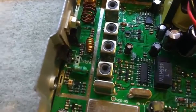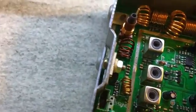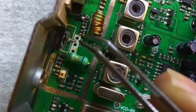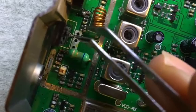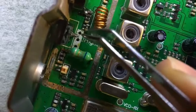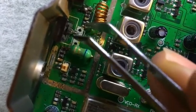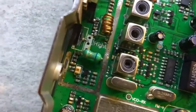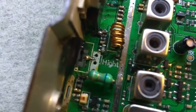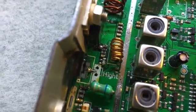I've been working on this some more and it looks like there's actually some missing components. Just in here there are two resistor pads side by side with nothing in them. I've put some resistors in — two stacked one on top of the other, so it's about 100 ohms from two 210 ohm resistors in parallel. And that actually got it transmitting.